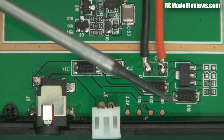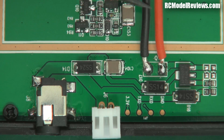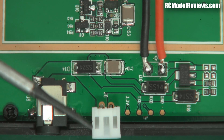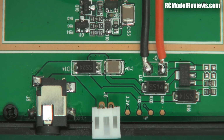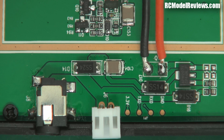The voltage then goes off over here. Now this is a little FET switch. It's a little switch because we have a problem. Here's the wires off to our internal battery connection, and here are the wires to our external battery connection. If we just wire these in parallel, then you can imagine that perhaps we're using our LCD and the internal battery goes flat, and it may be a 2-cell battery or 3-cell battery. So we grab a 6-cell pack and we plug it in here, and what would happen? Well, you'd be putting 22 volts across an 11-volt battery, and the internal battery would explode. Simple as that. It would be like LiPos do if you put too much current into them and you overcharge them. This would just go boom and the magic smoke would come out.